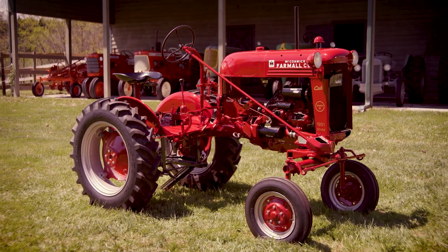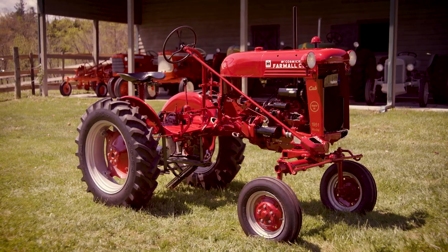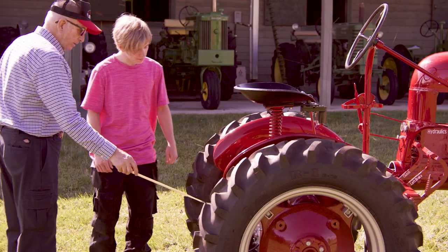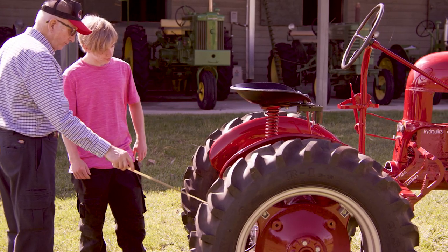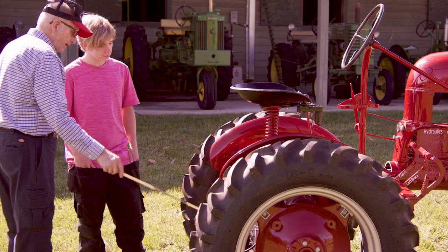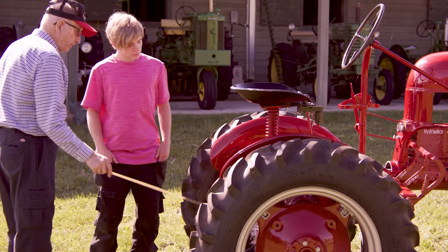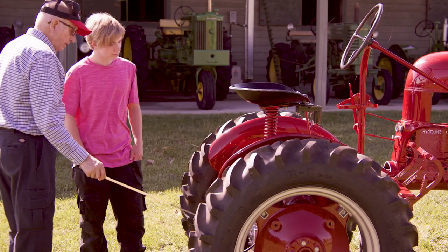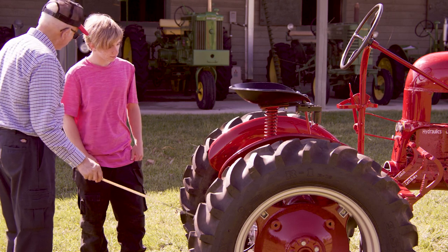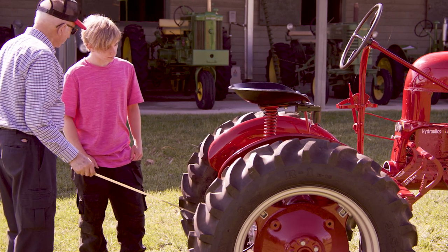It actually was a functioning machine before we cut it apart, and it shows how things work — engines still work the same way today. I took a heavy duty motor with a 57-to-1 ratio gearbox drive reducer, put it on the belt. I put a small pulley here and a big pulley here so I could get it slowed down some more, and this way I've got the engine turning about 20 RPM.